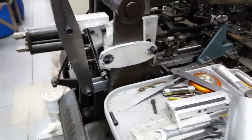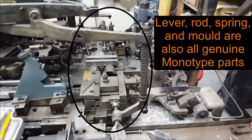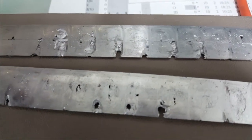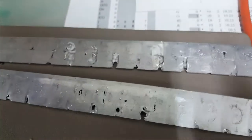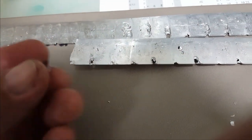So the whole thing goes through the motions nicely. I had to make my own nozzle too — there's a special nozzle for use on this pump. But I'm not getting great strip material. You can see here it's not really filling the mold properly and it's not really fusing properly either. If I try and take a piece here and just bend it, it just snaps right off.